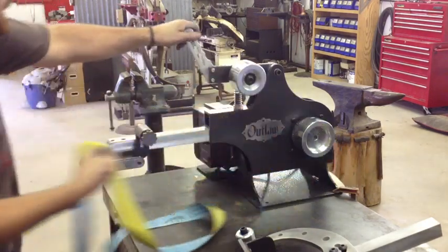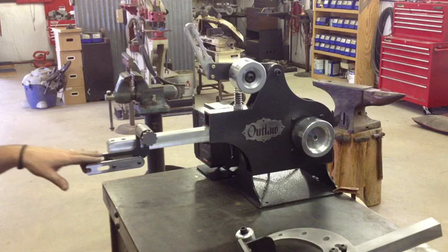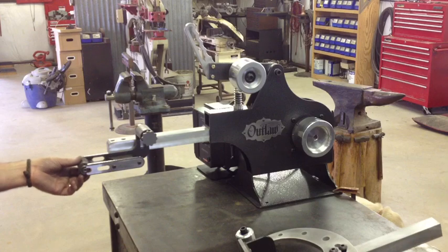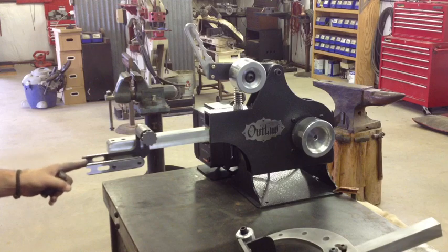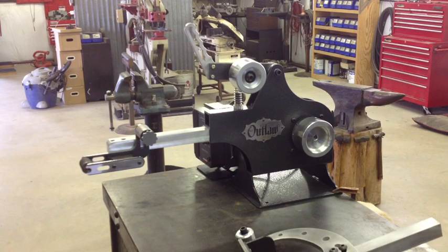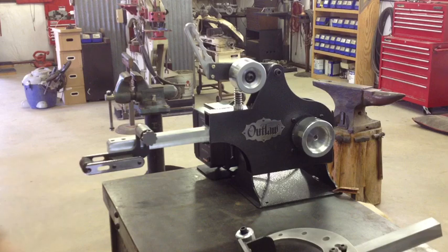This small wheel attachment is all built in-house — a little different design than most of the others you see. It's all steel construction, no aluminum, and the side pieces are actually stainless steel. There's a spring action here that actually grabs the bearings — there are four little fingers with a hump left on the end to accept the bearing. There's no pocket machined in there to collect grease and gunk that leaks out of the bearings along with grinder dust, so it stays really clean. The sides are also spring loaded, so if you get a set of rollers that don't hold a very tight tolerance, this attachment will accept those sloppy wheels as well.